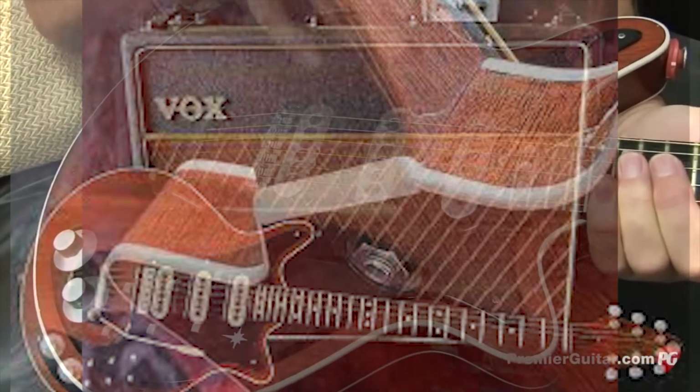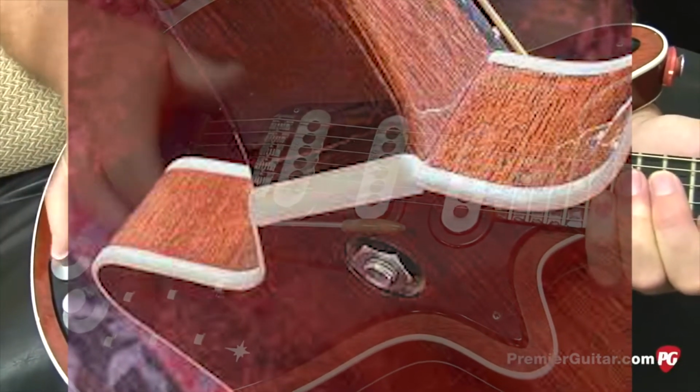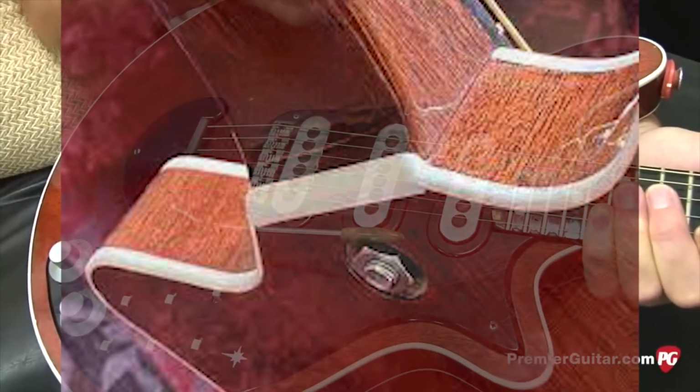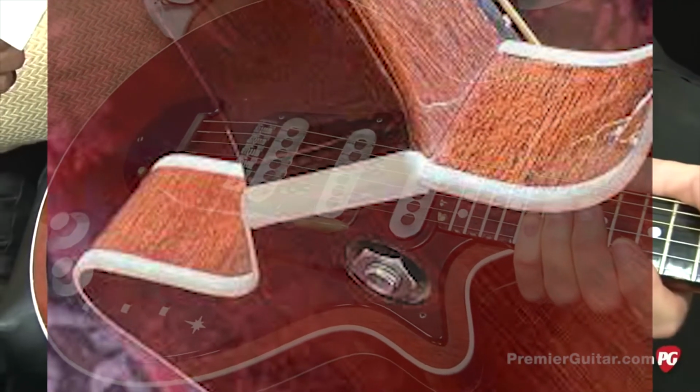Brian didn't have an amplifier yet, so he plugged into the family's radio. The pickups worked. They were very bright sounding, but had one flaw. When bending notes, Brian found there would be an odd sound as the string moved across the pickup. He attributed it to the north-south alignment of the disc magnet poles. Cutting the magnets was beyond the tools he had, and custom magnets were out of the budget. The pickups worked, and these were the original devices used in the Red Special.